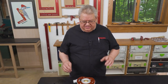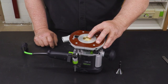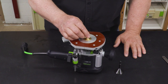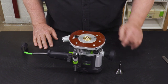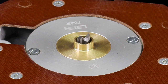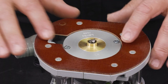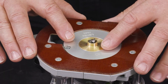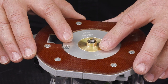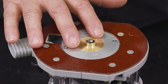Let's start with taking a look at how the jig works. This is a jig that uses a template guide bushing. The bit is inside that bushing and the outside of the template is going to ride on our jig while the cutter makes the cut. In any template guide bushing situation, one of the very critical things is that the bushing is centered on the bit, and it's very critical with the Exact Width Dado Jig that you get that as close to perfectly centered as possible.